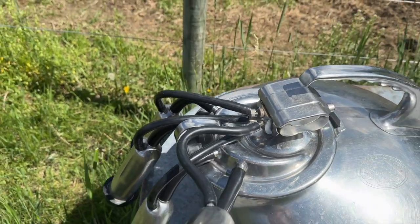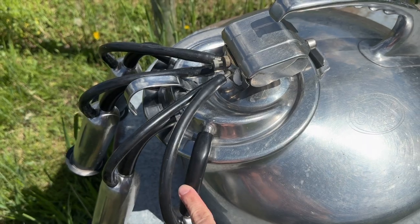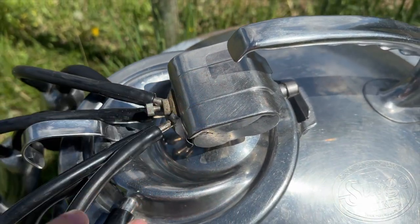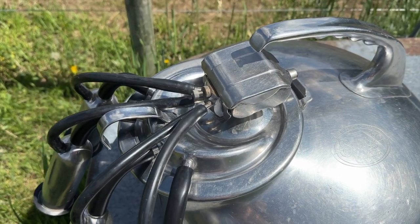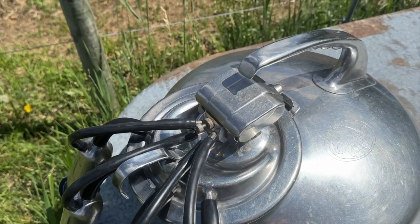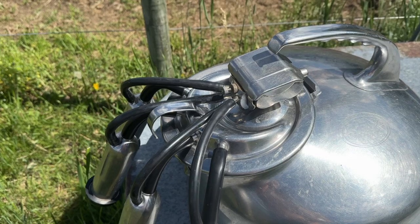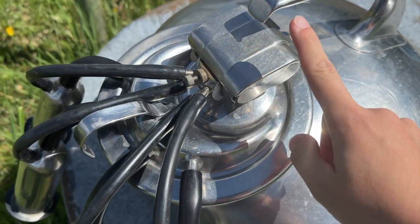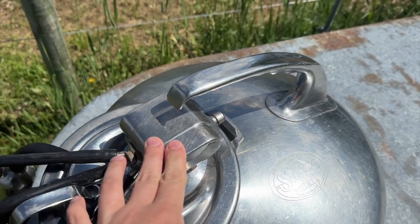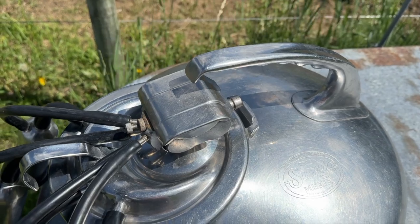These parts here are the inflations inside the cups, where the inflations sit. This is the vacuum line and this is the milk line. The lid sits on here with a little rubber gasket inside. This is the pulsator part — when you're suctioning onto the cow you don't want just constant pressure. You want to pulsate as if hand milking, to simulate how a calf would nurse. Constant pressure on a cow's teats can be damaging, so you definitely want a pulsator. This is a C-style pulsator; the Surge company had an older S-style version. This is the original pulsator, refurbished — you can buy refurbishment kits if you find one.